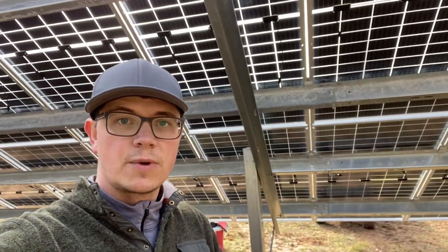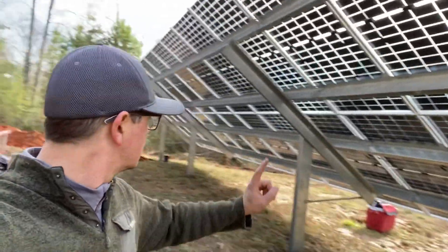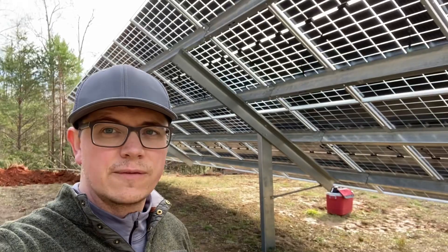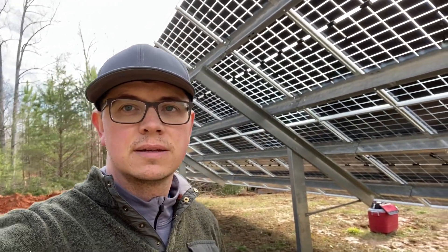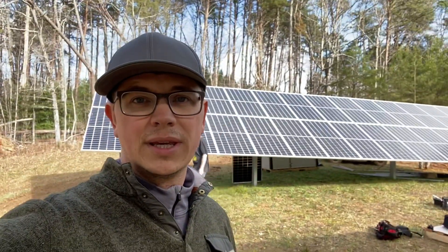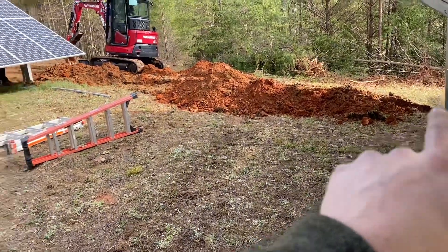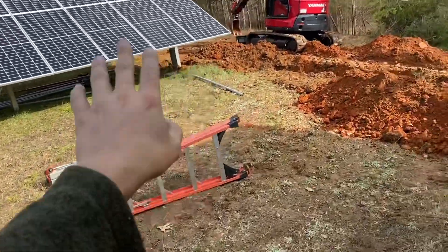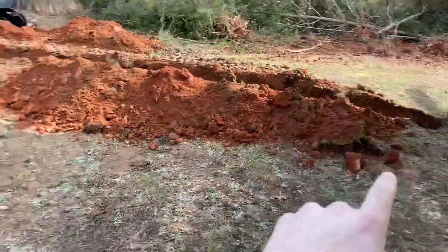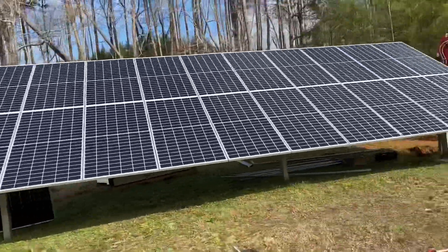We've just finished racking the glass — it's mid-morning and we just got done racking the glass on this new array. These are 28 410-watt modules; they look really cool and transparent. We're doing a little digging, pushing some trees over, trenching over to this array from the pull box where I have my two 2-inch conduit. It's going in with one-and-a-quarter conduit, and then we're trenching over to the back array as well.